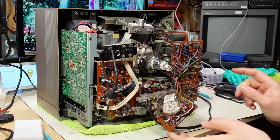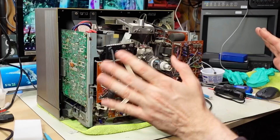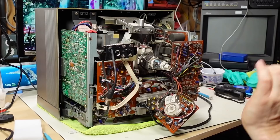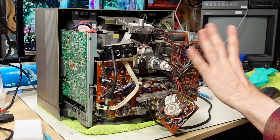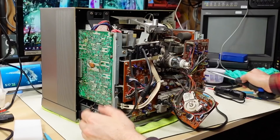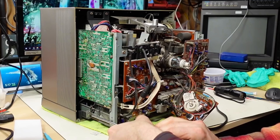After running for about 30 minutes with no issues and the picture still looking good, I slightly tweaked the controls — turned down the red drive and red low-light bias. The picture looks fantastic now, color balance is spot on. There's also a sub-brightness control I turned up slightly, which made the front brightness control work better. I had to crank the front brightness up to get the overall picture bright enough — could just be aging of the CRT.